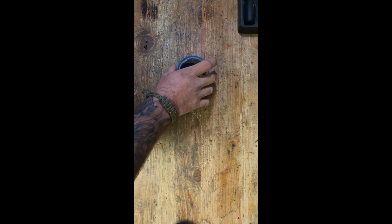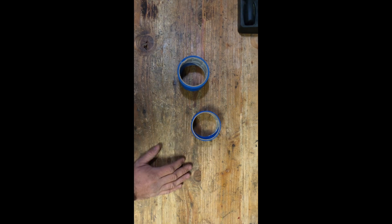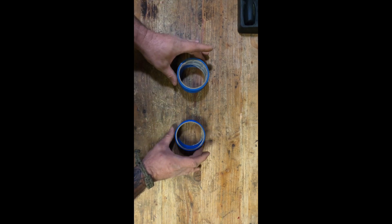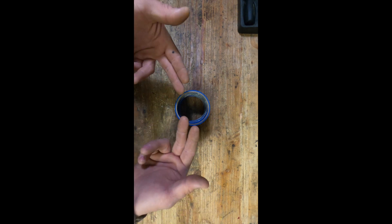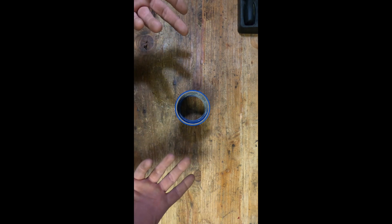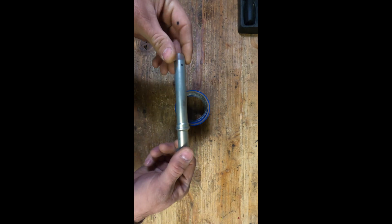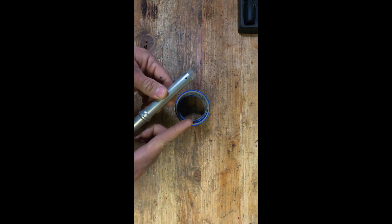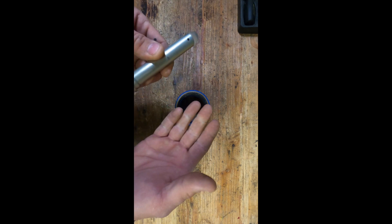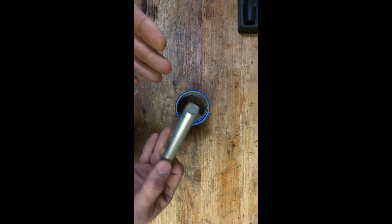It's a very simple process. We're talking about two holes: the hole in the barrel and the hole in the gas block. All we're doing is aligning those two holes so gas can flow through correctly and we get all the back pressure needed to cycle the BCG. A feeler gauge is traditionally used — usually a bent piece of pipe cleaner, a metal wire, bailing wire, or even a piece of spaghetti — and you'd just pass it through as the holes align.